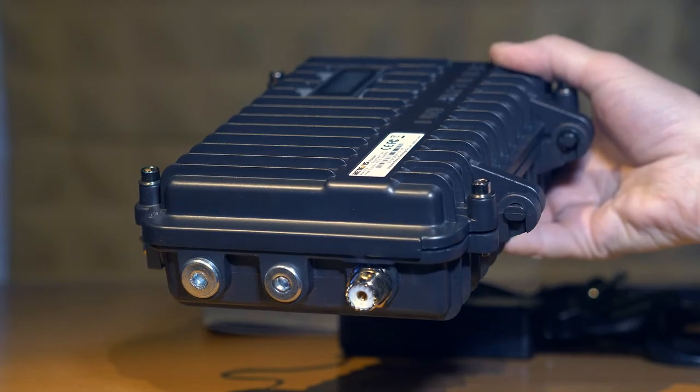In general, when repeater frequencies are recorded in some message, in some document or on a page on the internet, it is customary to designate the input and output frequencies, or the frequency of reception and transmission, in relation to the repeater. That is, if the receiving frequency is 435 MHz, and the transmitting frequency is 440, then the receiving frequency is the one to which the repeater receives. If you record these frequencies into your radio, then you need to record the receiving frequency as the transmission frequency in the radio, since the receiving and transmitting frequencies of the repeaters, of course, are meant in relation to the repeater.